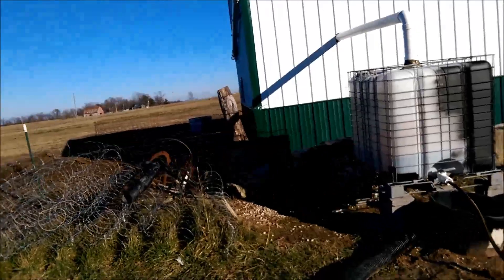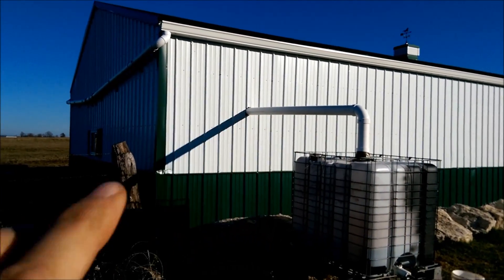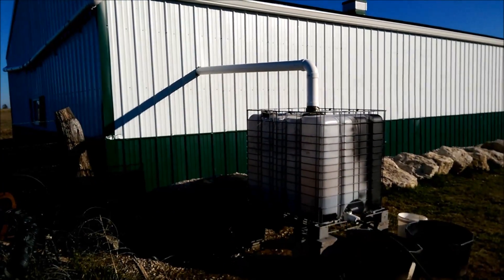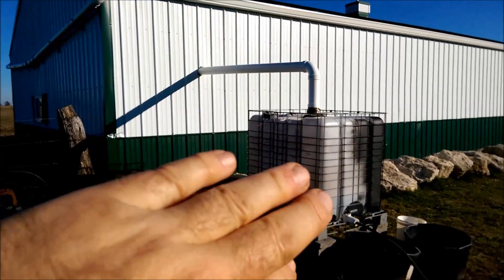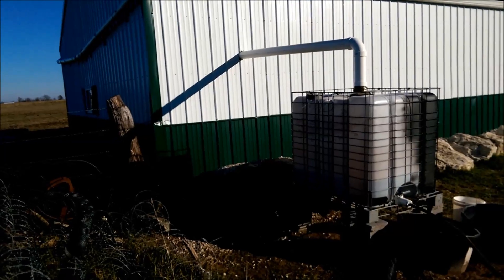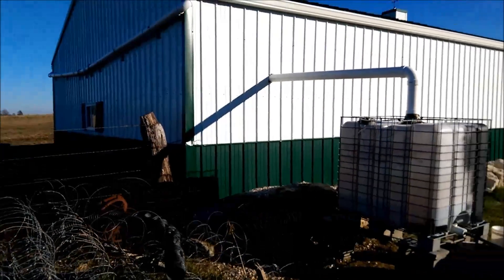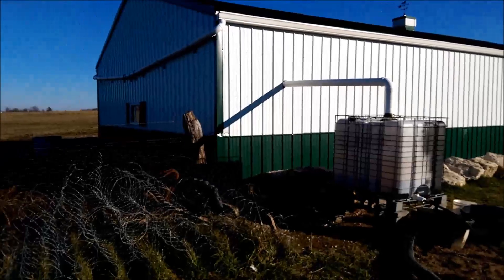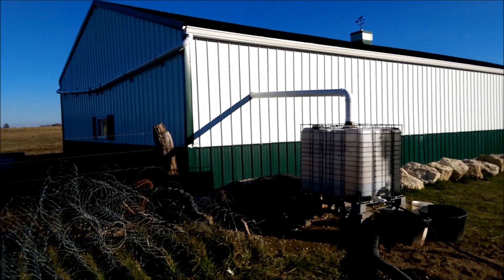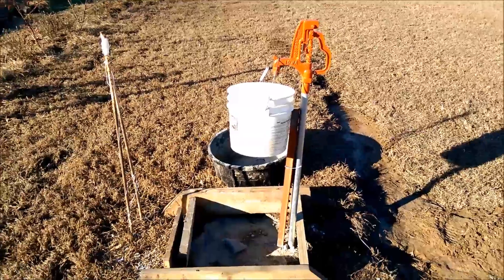I have to come out and actually empty this — let it drain out — because this is especially crucial in wintertime. I don't want any water in these pipes if it's below freezing. If the overflow tank is filled up I'll need to drain it so that as water comes into the system it can flow through and out. You want to drain that 250-gallon first flush diverter in wintertime too, keeping the water flowing so nothing's backed up. The only water remaining should be in the tanks, the connecting tubes, and the outlet going into the ground.